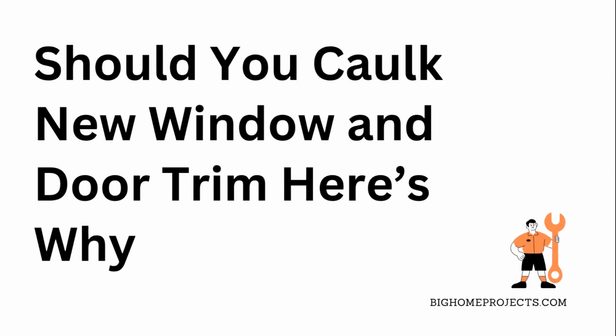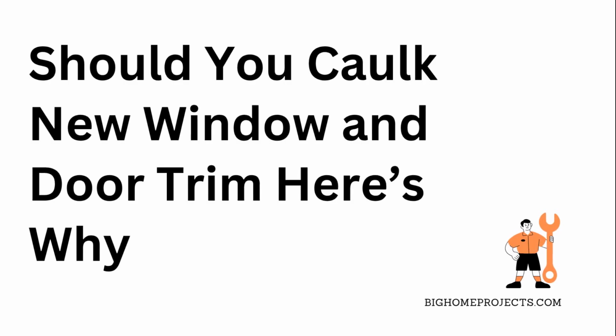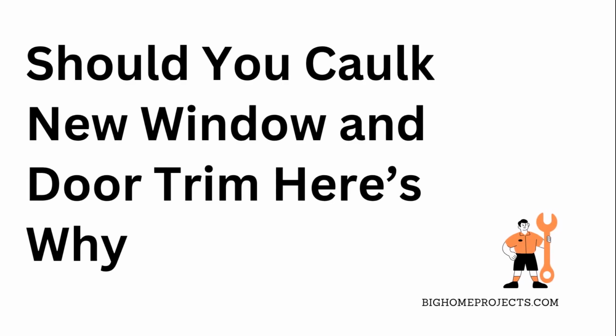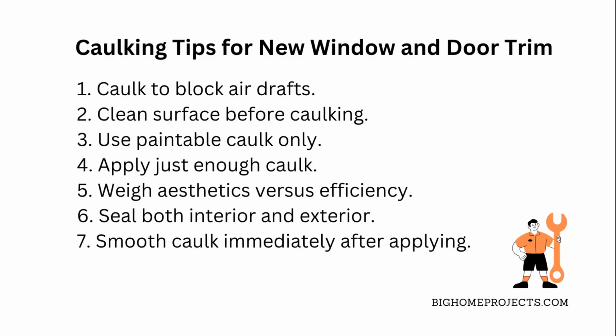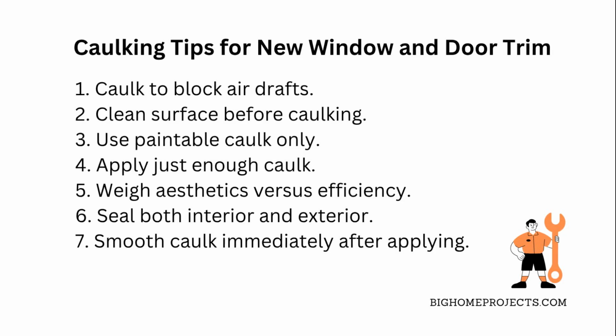Caulking between new window or door casing and the wall is one of those things that sparks a lot of debate, but honestly, it can really help with air sealing in your home and keeping things tight. So, here's the deal. If you want to keep drafts from sneaking in, caulking is your best friend. It blocks tiny gaps where air might slip through, which saves you on heating and cooling bills.